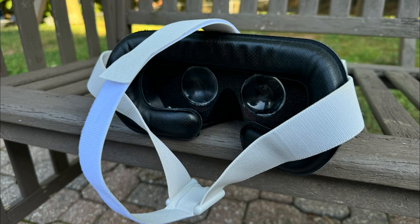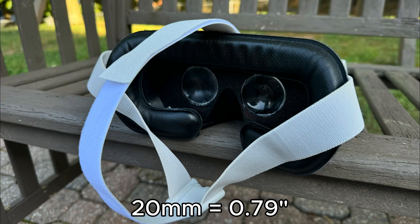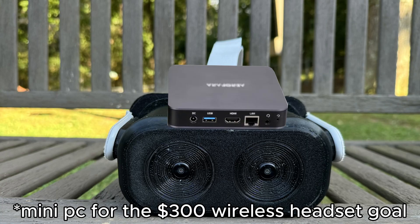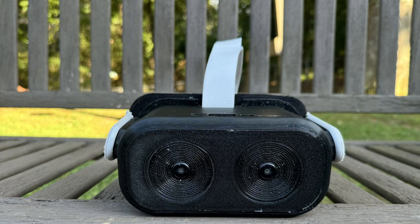In the 3D model I had a distance from my forehead to the front of the headset set to 100 millimeters, but I believe it could go at least 20 millimeters lower. If I swap out my laptop with a mini PC running Windows 10, attach a battery, and redo the CAD for a head mount, everything should work as expected. Seeing how fluidly my computer ran SteamVR and the SLAM at the same time does make me want to consider using a single board computer.